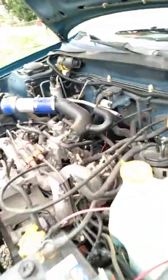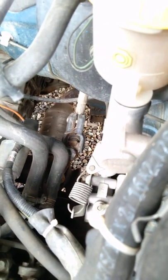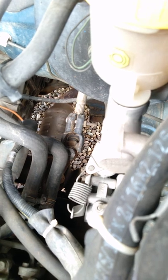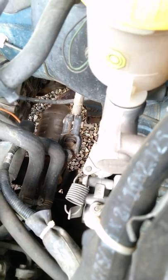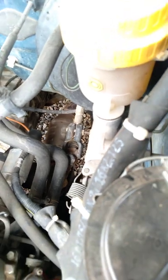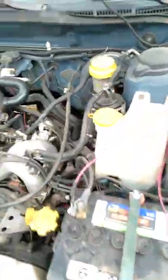With the four-inch lift, I did have to slide that knuckle down on the lower part of the steering wheel splines, so it's on there for about a half inch. That's definitely pushing it, but I haven't had any binding in it, and that was the biggest thing I was concerned about.